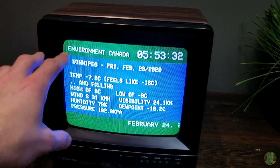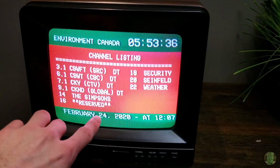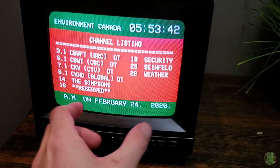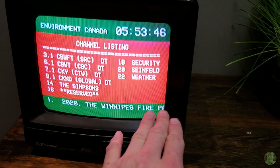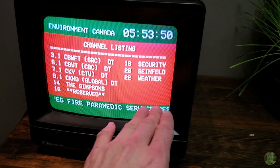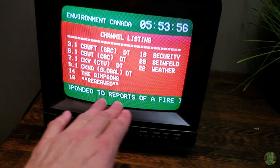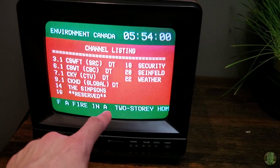So I'm probably going to be updating the code at some point to refresh this information and refresh the RSS feed information. And the other issue is I have a little thing that calculates how many characters, because this moves by pixel. So every 5 milliseconds or 15 milliseconds, it moves 1 pixel over. So I need to align how many pixels it needs to move in total before it resets versus how many characters are in the string when it pulls it in.